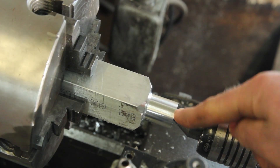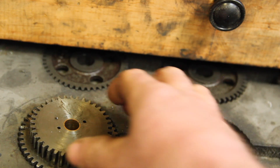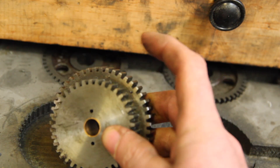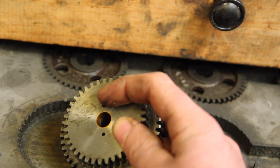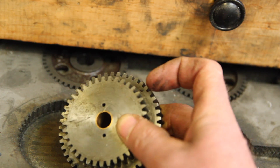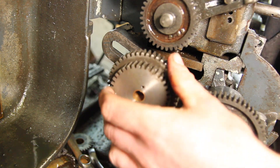Then I'm going to ream a 14-millimeter hole down the middle of it. And since this is a metric thread I need my metric transposing gear — this is a 37-tooth gear and a 47-tooth gear, and since they only ever get used together I pin them together, put a bronze bushing in there that just slips right on the stud.